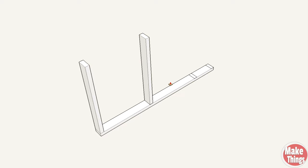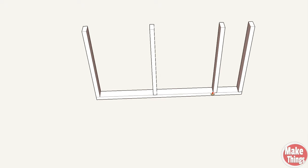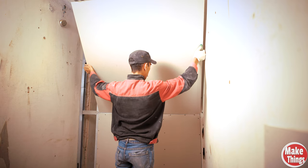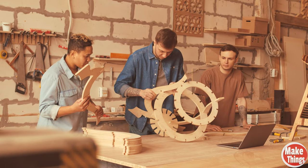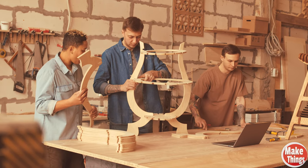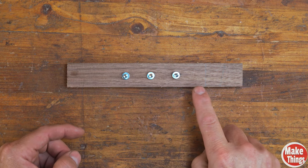If you're framing a wall in a home you start from zero, moving either 16 or 24 inches and adding a stud, continuing this process until that sequence is impossible. For example, a five-foot wall can take two studs spaced at 24 inches apart and then you finish the frame on the end — creating odd spacing that isn't symmetrical. If you're building fine furniture, a symmetrical system of spacing can make or break your project aesthetically. It took me years to figure this trick out: if you need to space objects between two points evenly, take the number of objects and add one.